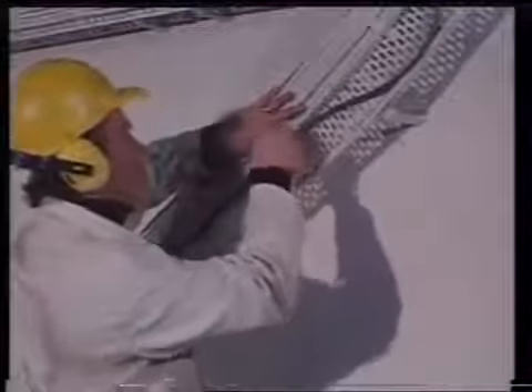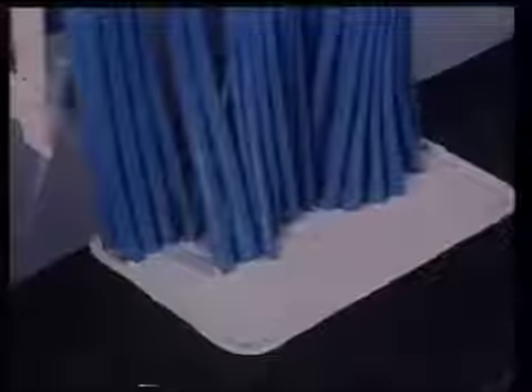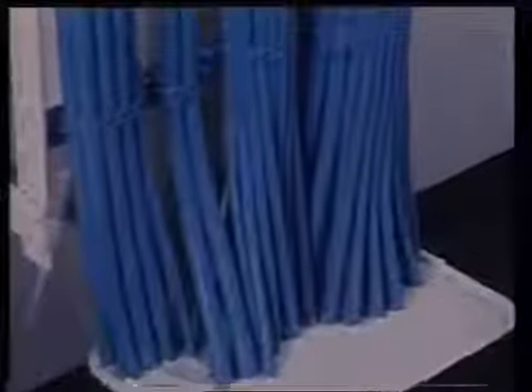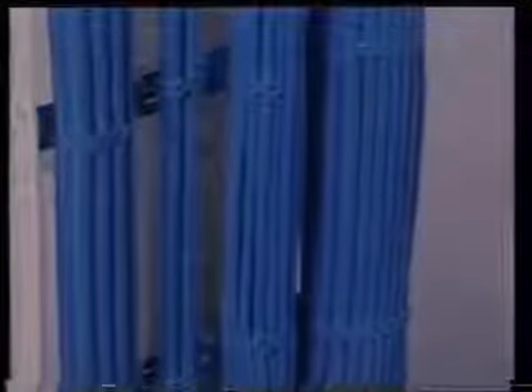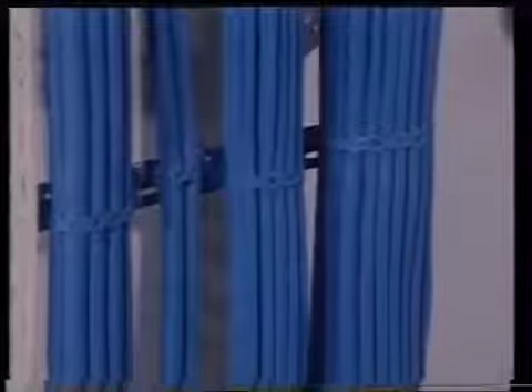All these circuits use thousands of meters of cable of different sizes and design. If a cable becomes damaged and is replaced, always use a cable of the same specification as that of the original. The ship's drawings will have the specification for all cable sizes. Lay the cable neatly in an appropriate cable tray clipped to ensure safe and secure hold for the cable. Cables for the intrinsically safe circuits must be run separately and clearly marked for identification. Here, colour coding has been used. Also, these cables should cross power cables at right angles and the screen should be earthed at the supply end only.